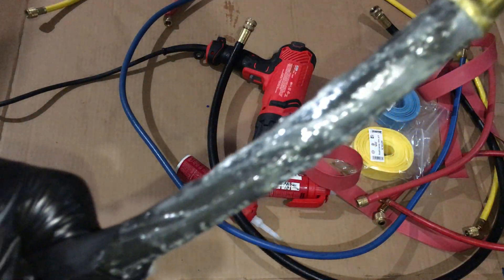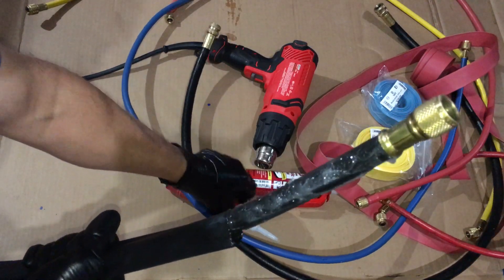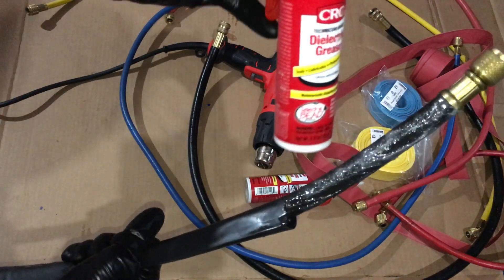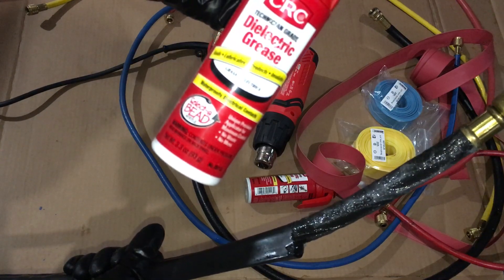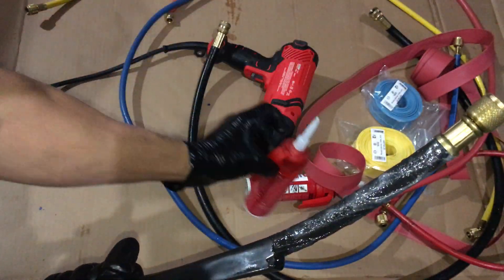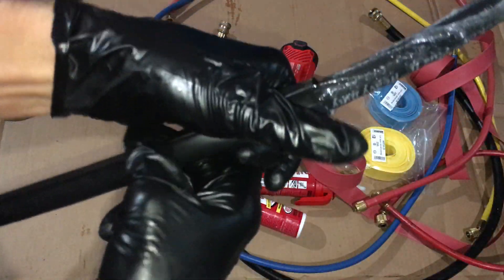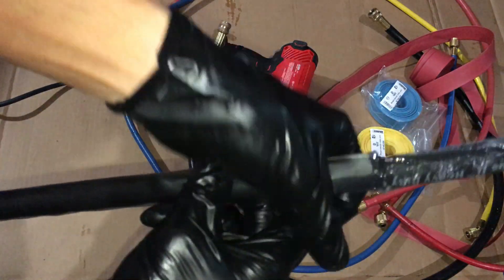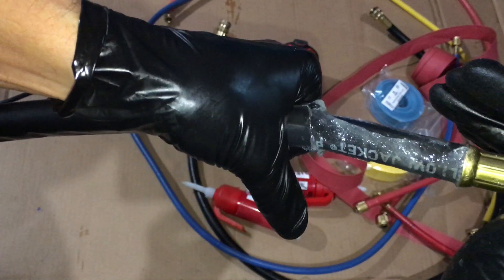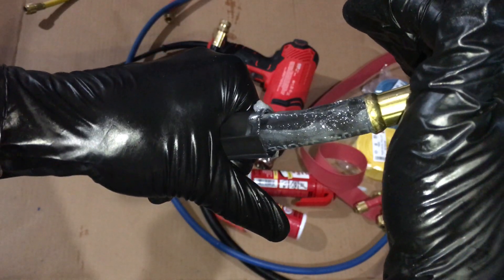You see what all this stuff is — this is silicone grease and dielectric grease. You also use silicone grease in a laboratory when you're doing deep vacuum tests and performing different functions. Vacuum doesn't pull through silicone grease. So as I coat the vacuum hose, I pushed the vacuum hose into its sheathing and I've been slowly doing this over its whole circumference, as you can see here.